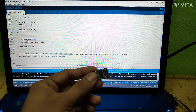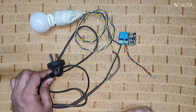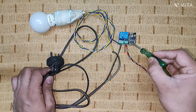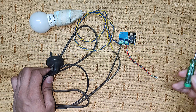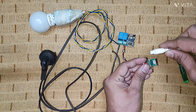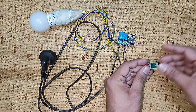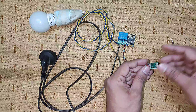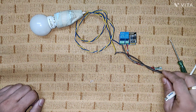My setup is ready. I have a power wire with terminals and a plug. From this plug I have taken one input to the relay into the common — that's my line. Via this switch I have given the line to the bulb. The yellow wire goes directly over here, so the relay will either cut or connect the line, turning the bulb on or off. To power the module I have attached a USB breakout board so I can use a data cable to provide power.